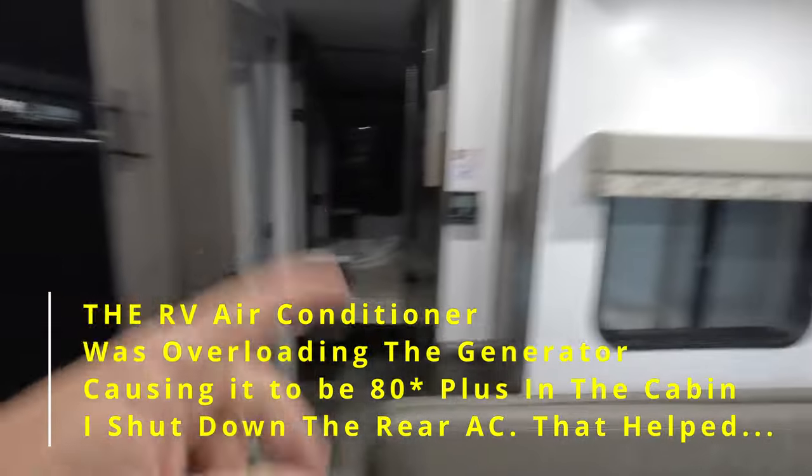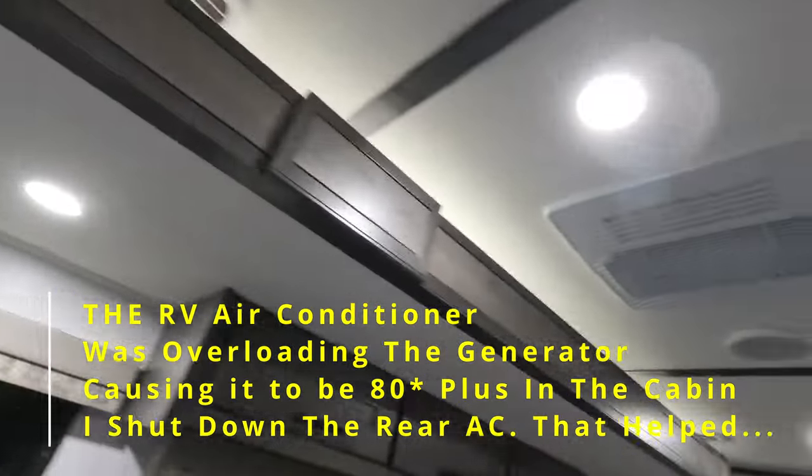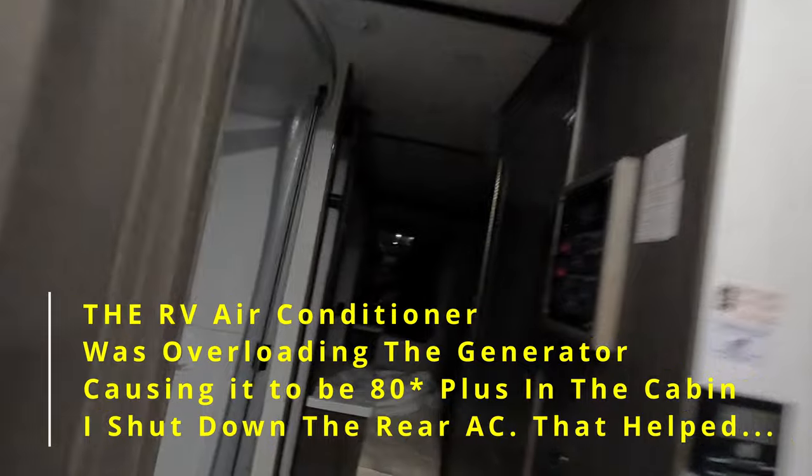ACs have been having issues. This one here, it's pulling about 14.9 amps, and then the rear one's probably going to be exactly the same. That's kind of what we got going on. I mean, if the stuff's running, what else do you need to do? It really ain't much. You guys know that. You don't sit around and babysit something. But it's one of the things where there's so much money involved, they're going to be precautious.